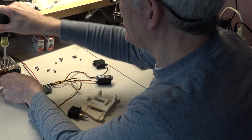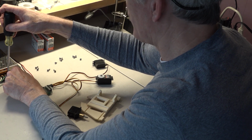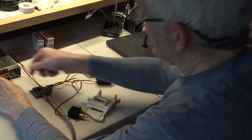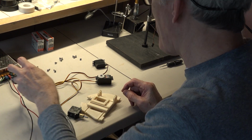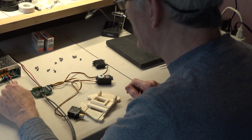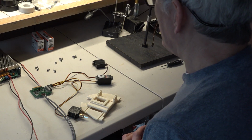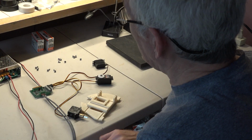Now, another important thing about hooking up the power to it is right now this power supply is off. And when you're connecting your connectors, whether they be bare wires or fork terminals, the power supply should always be off. The reason is, when you're connecting it, there's going to be points where you're just touching it and it's not tight yet, and that's going to be like a million little instantaneous connections to the board, powering it up, powering it down, powering it up, in rapid succession. Turning it on and off like that can confuse the CPU on the board or the program chip. It won't break the board, but it will break the programming, and it would have to be reprogrammed. And so we don't want to do that. So make your connections, make sure they're tight and secure on both ends, and then turn on your power supply.